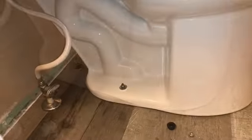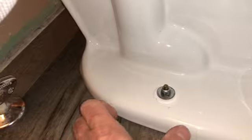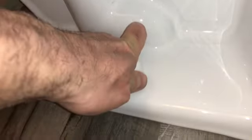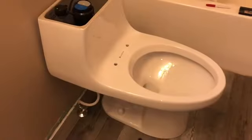Do not over-tighten with the tool — just give it a little pressure until you feel it getting tight. Make sure you sit on the toilet and push the wax ring down before you finish tightening. You can see how the caps have grooves — put some pressure on them and give a little twist, and they snap right on. Once on, they won't be moving when somebody's cleaning.